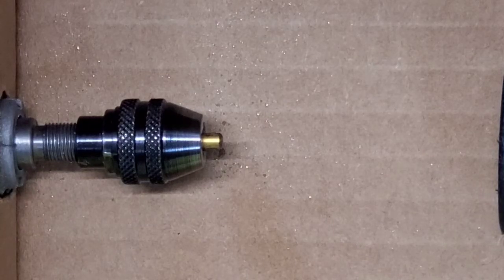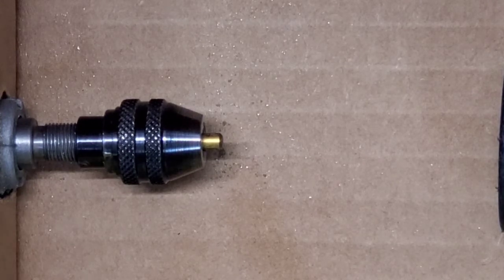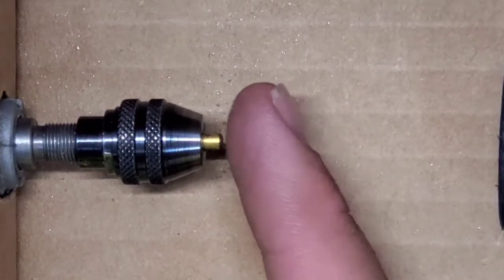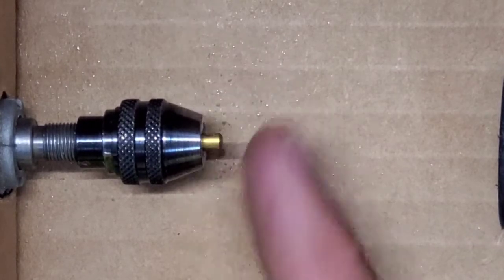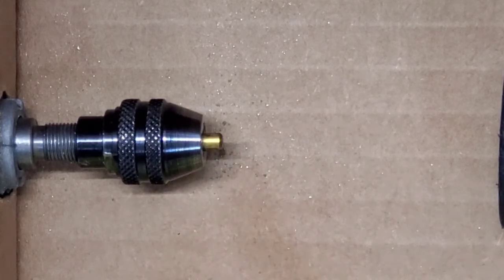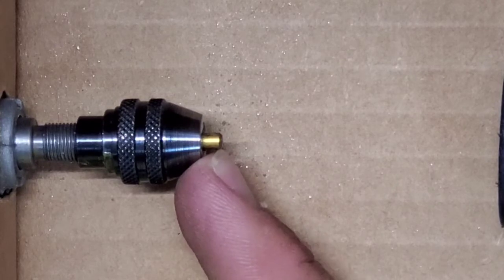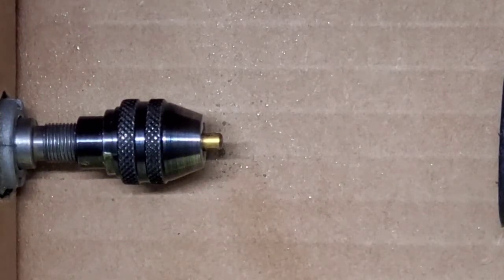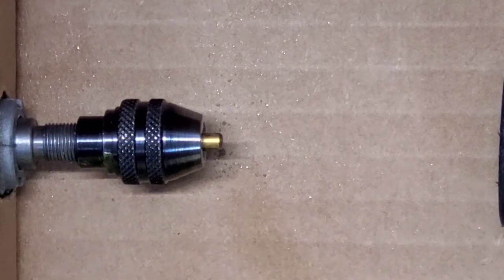Okay, next pin we're going to make is a serrated spool pin. This is the driver pin for chamber two. So I've got it chucked up here. First thing I'm going to do is cut the end flat so that there's no bevel on there. When I make challenge locks, I like them nice and flat. The bevel, I find, tends to make it a little easier because it opens up the gap on the shear line, and I want nice straight edges.